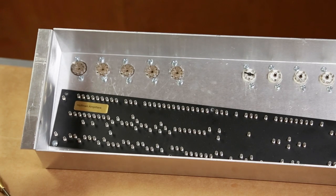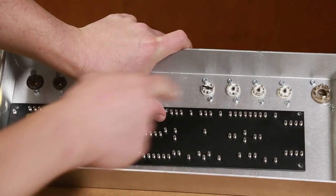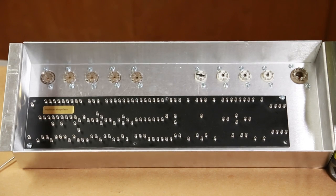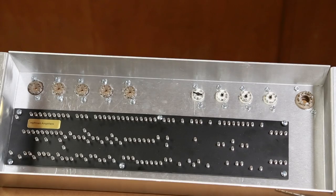I've got the first screw in at the bottom left corner. I'll adjust it until it's perfectly straight, then mark the top right corner and put that one in, locking the two together to line up each hole. I do one hole at a time because if you miss one it becomes a nightmare of trying to widen it. I was able to get the first two dialed in. In theory I could mark the rest now, but I still prefer going one at a time.